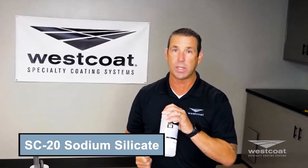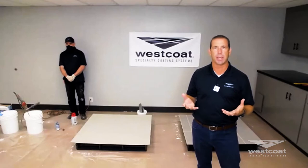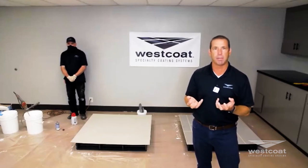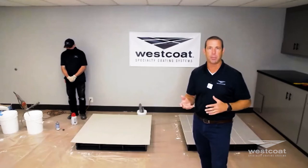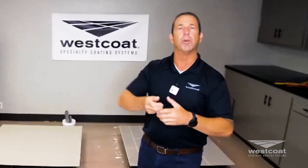This is SC21, a lithium silicate — part of our polishing line, but more importantly a concrete densifier. I also have SC20, a sodium silicate that's been used for years to greatly reduce moisture emissions. There's no guarantee, but it can stop the erosion of concrete below the surface. It looks and smells like water, is spray-applied and broomed on, and you wait 24 to 48 hours. You'll often see excess white fuzz — efflorescence — leaching out, and people call saying it got worse. We tell them: it's working as supposed — it's crystallizing.